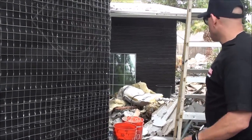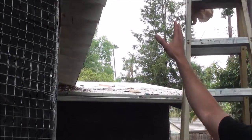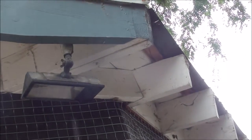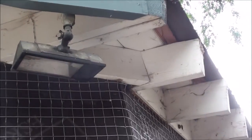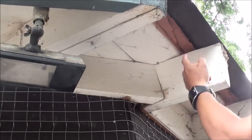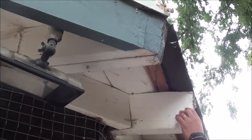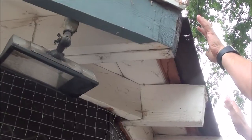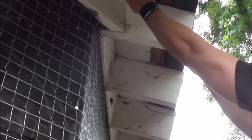There's still debris in the side yard, so we might use the entrance hallway or the other side, but we do have dry rot in the eaves. The way that we get rid of dry rot or termite is to completely replace the wood. The fascia board was removed. The inside is called the eaves. The eaves have also been compromised in some sections, so the only way to get to the eaves is to lift up the roof line, remove them from the upper part of the roof, and reinstall them. These are tongue and groove slots, about half an inch by six inches.